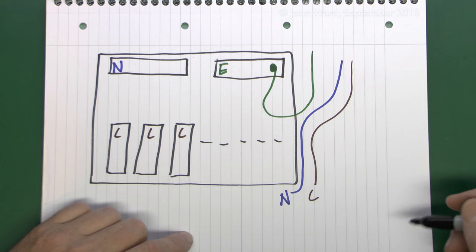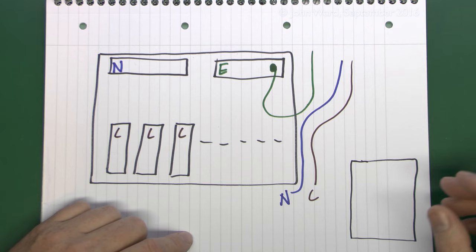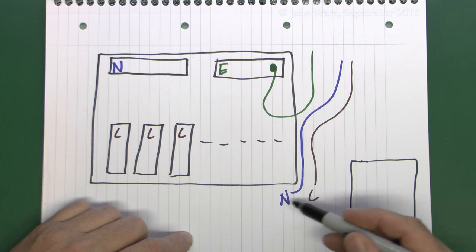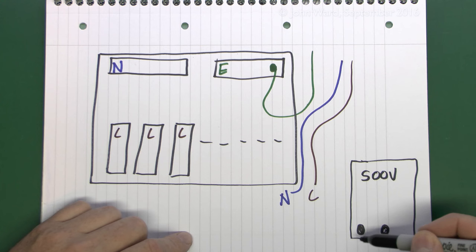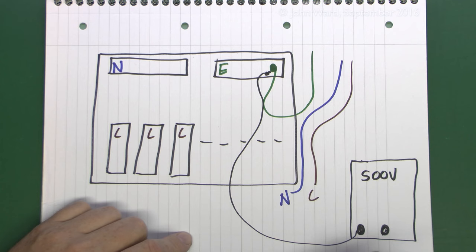In terms of test equipment, it's quite straightforward. You can get dedicated equipment with just that single function, or more usually these days a multi-function tester where you select the appropriate setting. You'll have two leads coming out of the device and it's a question of connecting one to each of the things you're going to test. You do need to select the correct test voltage — typically 500 volts on the device itself. Then connect one lead to the earthing of the installation and the second to either the neutral or the live as required, press the button, and it displays the resistance.